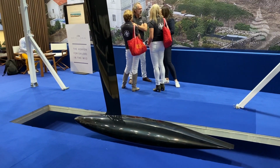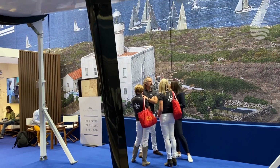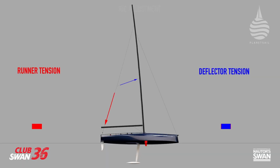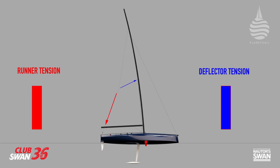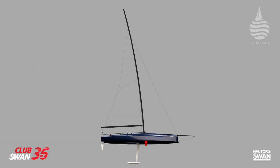That was the concept. But then, and then I get to the rig, in order to exploit this properly, you need the boat to be very light. The biggest part of the boat is the bulb. So you say, well, how do you reduce the weight of the bulb? And the answer, or at least the answer we thought, was to have a very efficient rig when it comes to depowering and feathering the forces that you have. If you didn't have that kind of rig, and if you had a very stiff rig that doesn't allow you to go through a big range of depowering, you're forcing a bulb which is as heavy as the overpower situation of the rig is, and therefore 90% of the time you end up sailing with too heavy a bulb. And so that's how the things relate to each other.